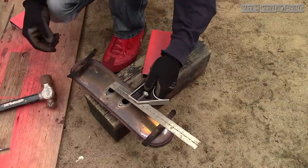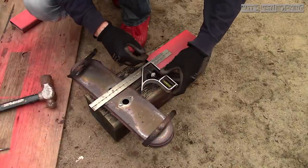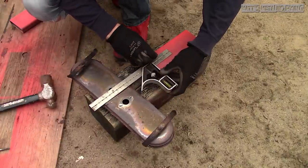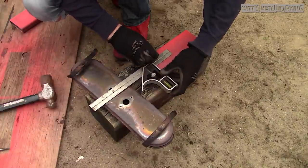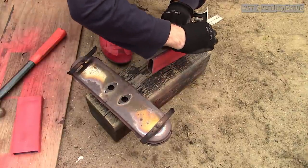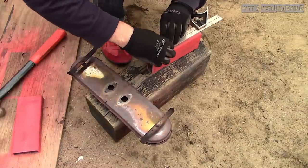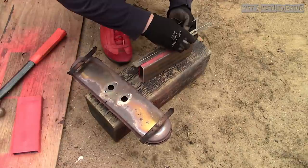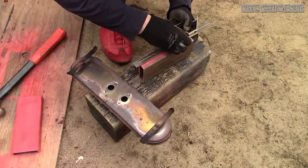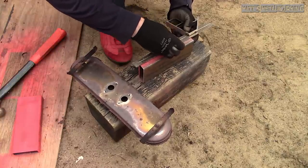First is marking out the main feed holes for the propane. I'll mark the center of the holes then drill them, and then mark out the screw holes afterwards. Here I'm using a scriber and a square. Next is marking out the flame holes on the side of the tubing. The original burner on the barbecue does have curved ends to allow for the flame to go all the way around. In this case I'll just be creating holes on the front and rear portions and the sides will remain solid.